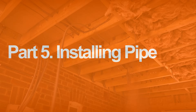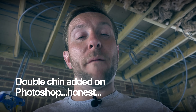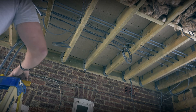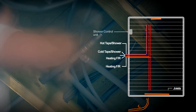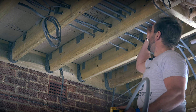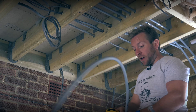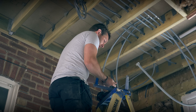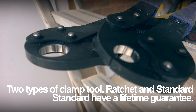Now I've got all my pipes kind of first fixed, laying in the positions where I need them, and now I've got to join them together up here above me. Now that we've got our two tees in here for hot and cold, we're going to run them across and drop them down, and the airing box is going to sit just on the wall there. It's really easy to do up those two tees just like that - clamp them up nice and easy, nice and quick, and that joint is done. You never have to worry about it again. It also shows you how small the actual clamps are themselves - literally the size of a standard set of grips.